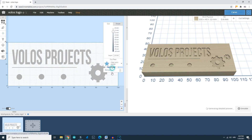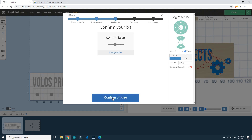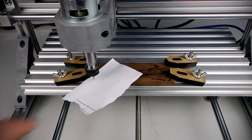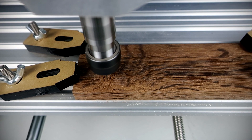Here is the name of my YouTube channel — feel free to subscribe — and here are some gears. I can set the depth of each element. Here are some carving settings, and when I'm done I need to click 'Carve.' This program is so easy you can learn how to use it in minutes. I need to adjust my zero point using these buttons. Don't forget to set your Z-axis to barely touch the wood, and now I can start carving.